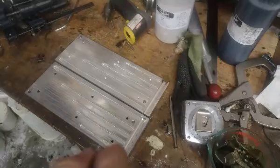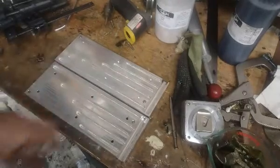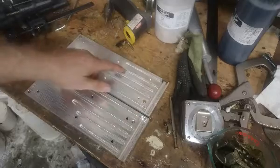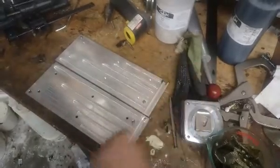This one may get a little bit of drawback if you don't keep the main sprue runner topped off. So you shoot it and you just have to keep pouring plastic into it until these two freeze off, or at least until these two freeze off, because it will continue to draw down. I would just sit there and top it off.